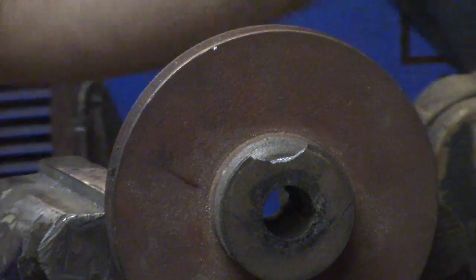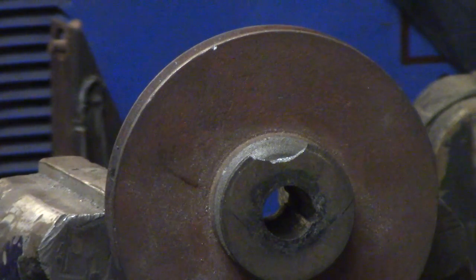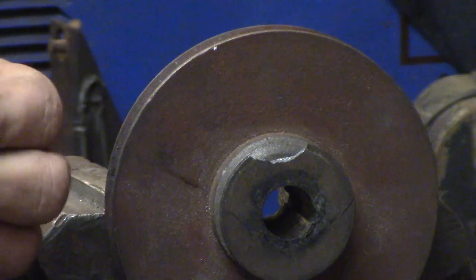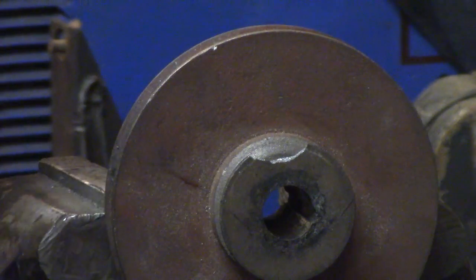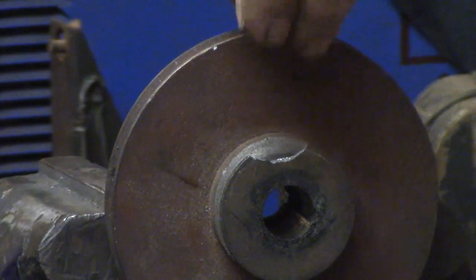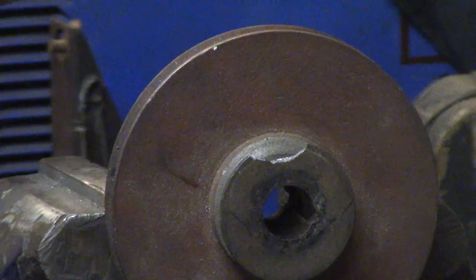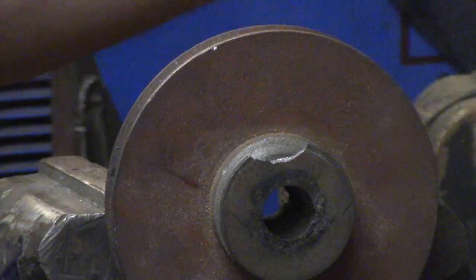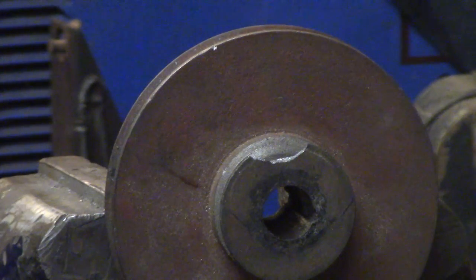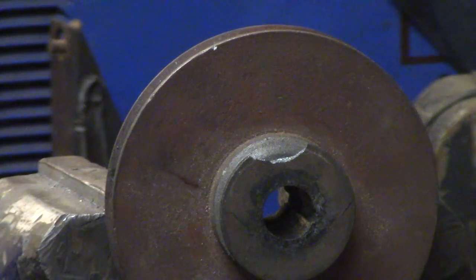The other thought, and something I read, said something about free graphite granules flopping around, and I really don't know what this crap is made out of. It's Chinese cast iron. So we'll see how it wets. If it wets, I'll tin it, and then I'll see if I can get this little piece to stick on top. I'll leave the jaggies to give it some kind of mechanical holding. If it doesn't work, we'll grind it and start again. This is all just farting around, because no matter what you read or what you see, you really don't understand it until you do it yourself. So, turn on the gas and start making a mess.